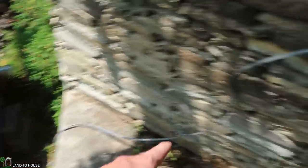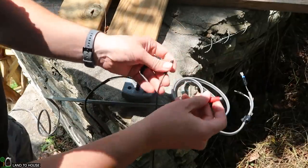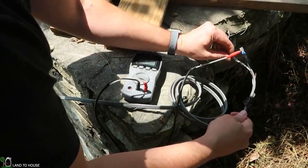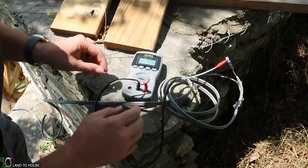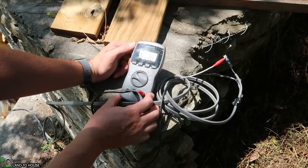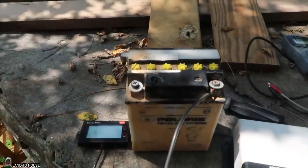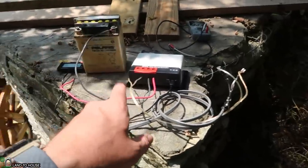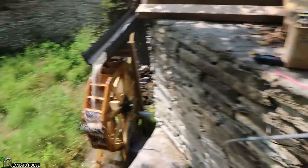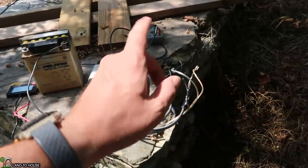He simply has some wire coming up here, and we'll go ahead and get a voltage reading. I need to remember that everything is live, so I don't want to touch anything with bare hands. I'm only seeing 7.5 volts, so that's not spinning too good. I have some wires here that will go to the charge controller and hook up to the battery. My anticipation is that when this load is connected, the wheel is going to slow down a little bit, or there'll be some slippage on the belt. Probably not much considering it's just pulling 7 volts, but let's give it a try.